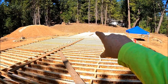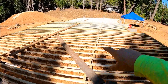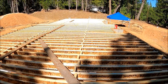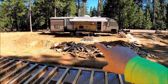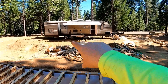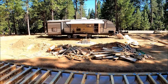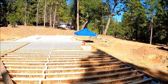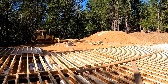We came up short — we ran out of time at the end of the day, so I've got a little bit of blocking over there to do, because these blocks basically go right over the girders. This row got finished all the way out to the end. Tomorrow they're going to finish the blocks and fabricate a couple of sills for the shear wall going around those columns for the portico tray. Then they'll go around and make sure everything's fine-tuned for the inspection.